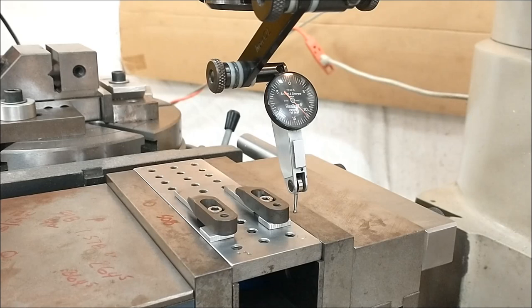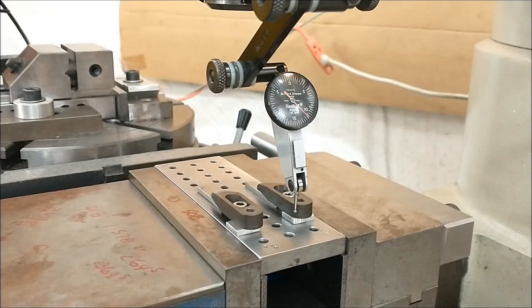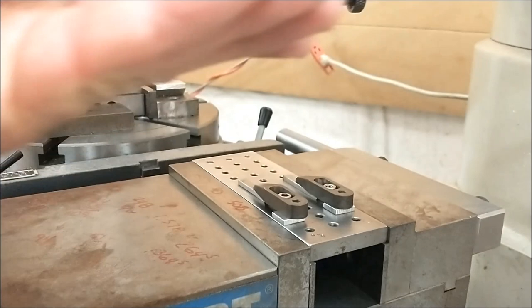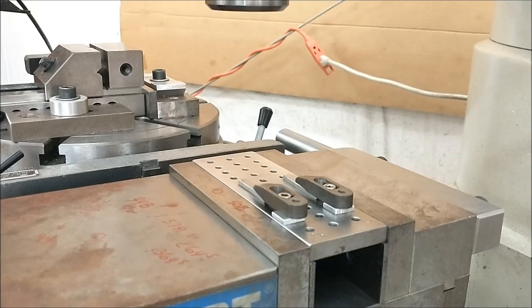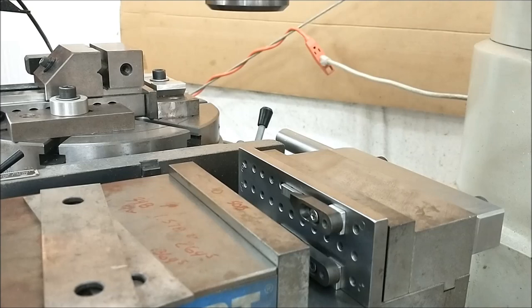First step in the apron cross drilling process is working off my little fixture plate. I set a pair of stops. These are my little toe clamps that I use. And right now all I am doing is establishing that they are true to the y-axis, which they are. When I use this particular setup, I'll be using it in this rotation. And now I have a vertical surface to reference the apron casting from.